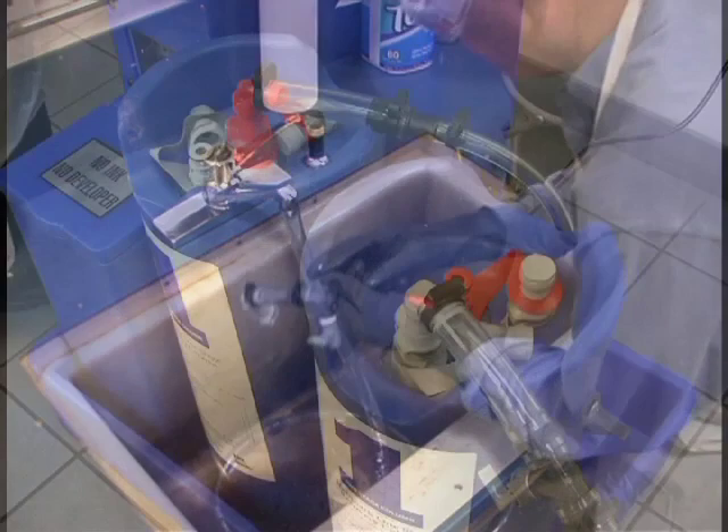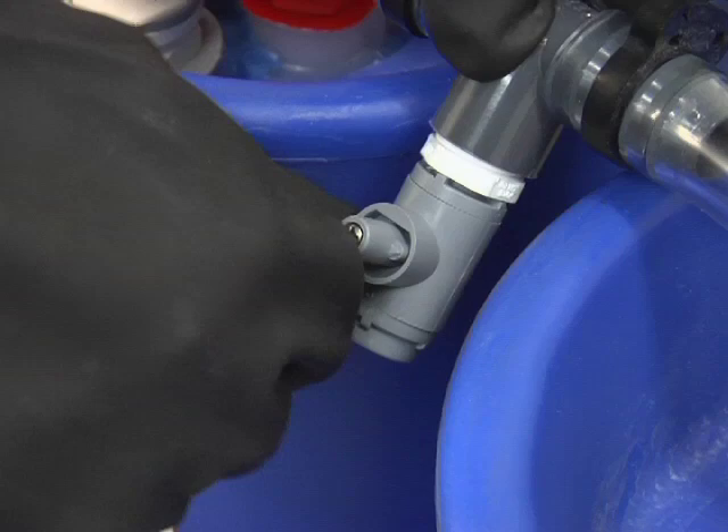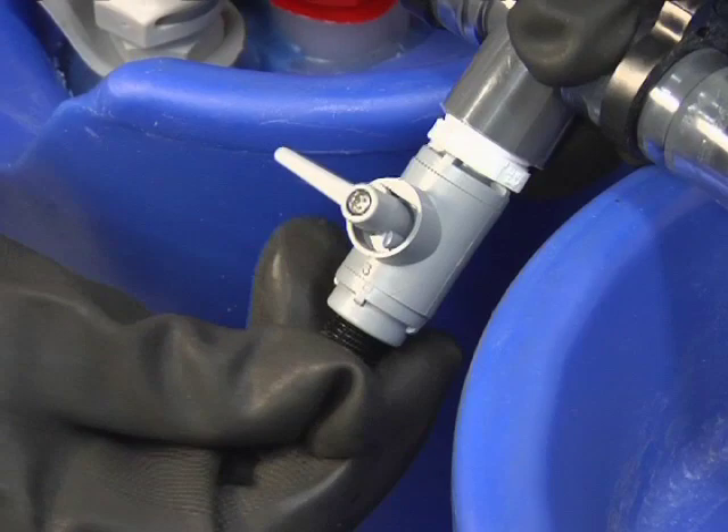Reinstall the bridge assembly by clicking the gray elbow on the gray out of the primary column and the red elbow on the red in of the secondary column. Be sure the sample valve is closed with the lever side to side and replace the black plug by twisting it clockwise into the open end of the sample valve.